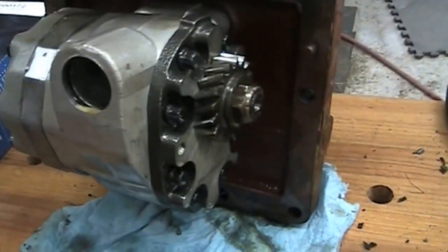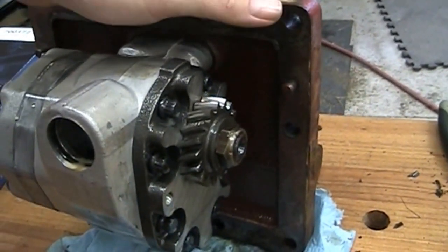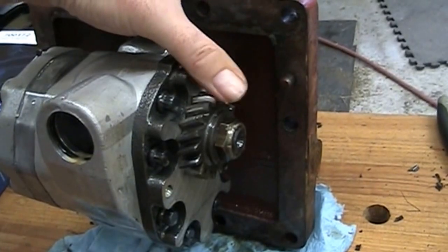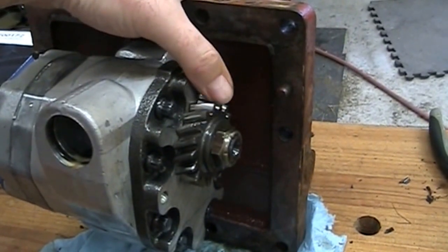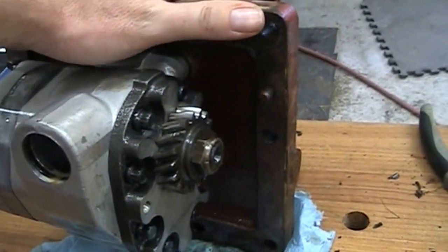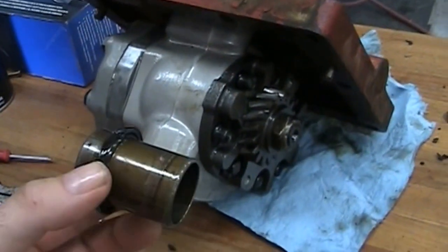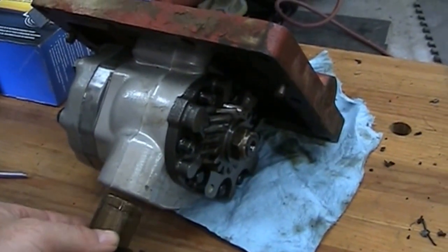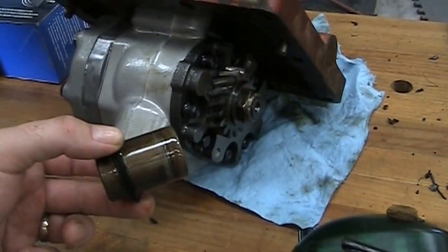This is a Cessna brand pump. I bought another one from Abilene Machine that I'm going to take the bolts out of and attach back to this flange. I have the correct gear on this — the early models had a 15-tooth sprocket, but this has the 17-tooth, which is what you want. That also means it has the longer suction tube, which goes across the middle of the tractor into the filter housing, so it's a little longer than the early varieties.